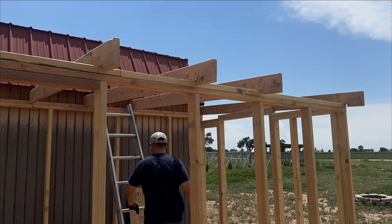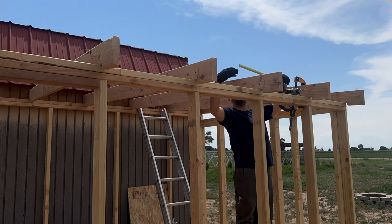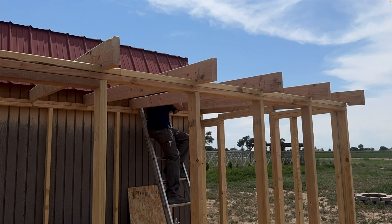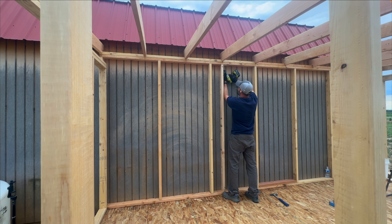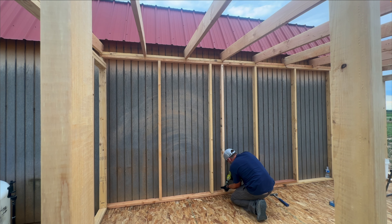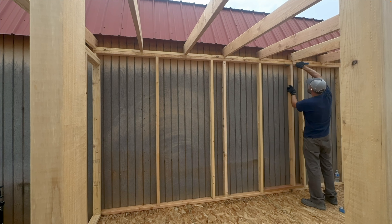It's sunny but there's rain in the forecast, so I'm going to try to get as many more rafters done as I can before that puts an end to my work today. It's always something, but that's what's great about working outside. Here I am adding in those extra studs to the existing wall right underneath the rafters — again, 24-inch on center spacing. I guess it's a good thing I learn best from my mistakes.